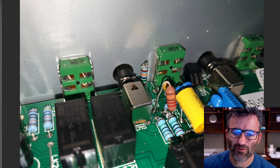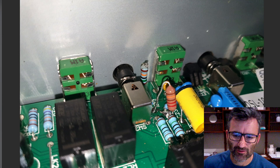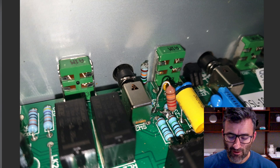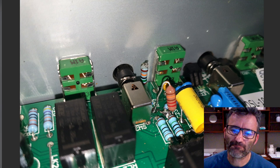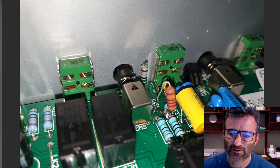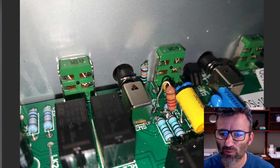All right, so I've tied the legs of those resistors, and this one here, which is the 1 meg to ground off the gain wiper, I've tied the legs of those underneath the leg of this resistor and soldered them in there. You can see this is the new coupling cap, and you can see the leads are just bent over and soldered straight into the top of the board there, no problem.